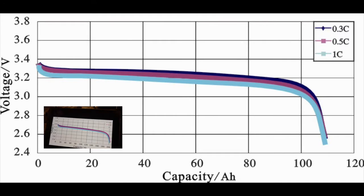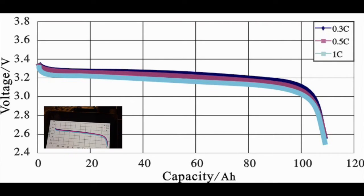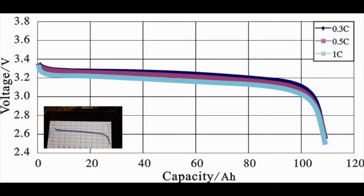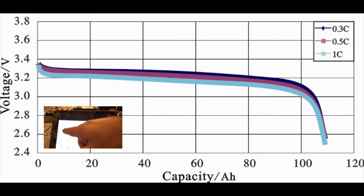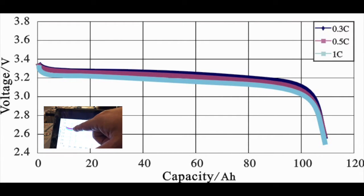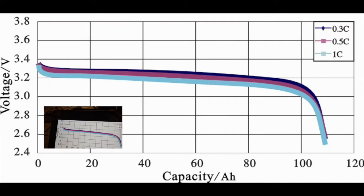You're just begging for something bad to happen if your cells get a little out of balance. The entire pack: 3 volts times 8 cells is 24 volts. If they're a little out of balance, some could be a little higher — and you may have already lost a cell. That's why we cut it off at 3 volts; it's a safe point. You can also see on the charge curve that same kind of elbow, just inverted. As you start to use the battery, the first two or three amp hours draws it down below 3.4 volts very quickly to that 3.2 nominal voltage.